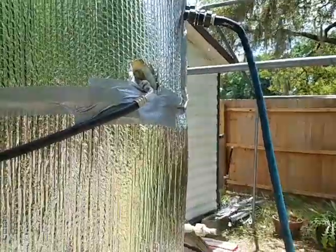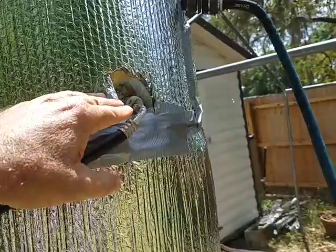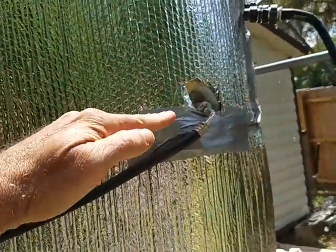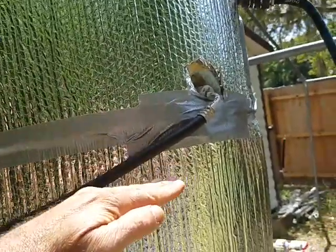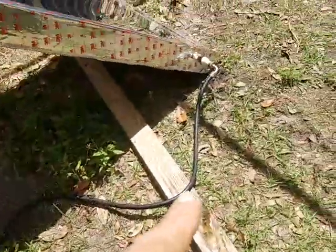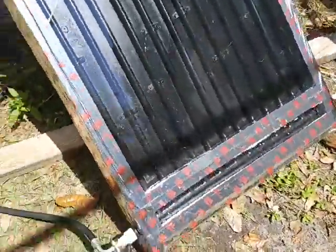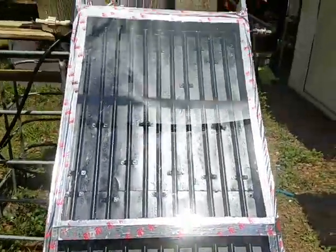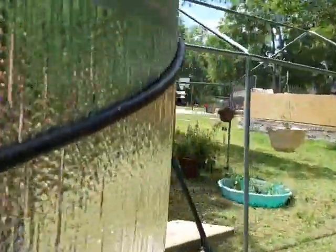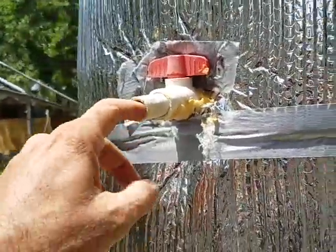So cold water comes in and goes down to the bottom, and this is where our hot water goes in. You don't want to put the hot water in at the very top — you want to put it a little over halfway so that the heated water can rise up and stack. By the time it hits the top, if you have more hours of sunlight, it's going to keep stacking as it pushes cold water down. Cold water comes out from near the bottom, runs down to the bottom of the panel into the manifold, then rises up to the top, comes out, and rises up into the barrel.